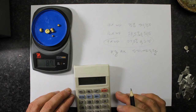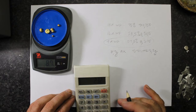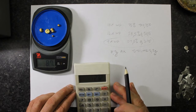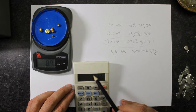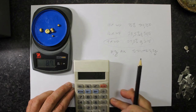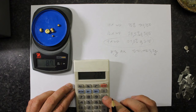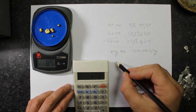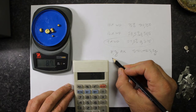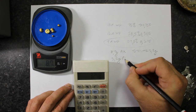For the 9 karat white gold I like to use a 14% palladium content. The next step is to work out what 14% of 23.2 grams total weight is, so I take that and multiply by 14%, and that gives me a total of 3.2 grams of palladium.